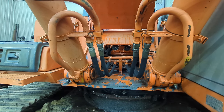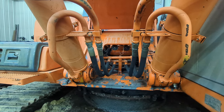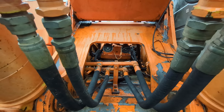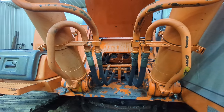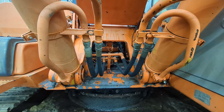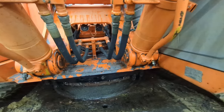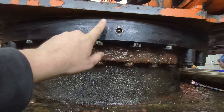So what we're going to do is pull that swing motor out, reseal it — the swing motor and gearbox — and pull out the rotary manifold for a new one we have here at the shop, which has needed to be changed for a while. The way you know these excavators need something done with the rotary manifold is one, you'll have a track that gets sluggish or both tracks that get sluggish, and you'll also have oil coming out of the swing bearing.